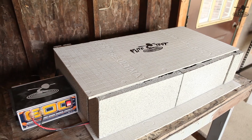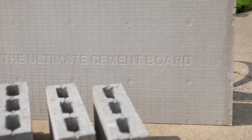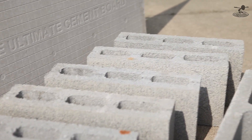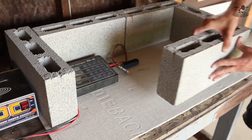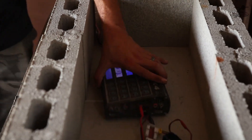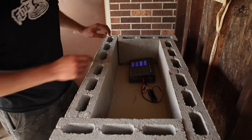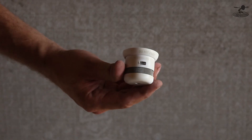So today we've made a new battery bunker. How much did it cost? About 20 bucks. I went to Lowe's and bought one sheet of two-by-four Hardy Backer board — that's cement board, and you can cut it with a utility knife using the score grooves on it. Then I bought six thin-wall cinder blocks. I simply made a perimeter, put the charging station inside, and placed the DC power supply on the outside since it does get hot after a while. Then I made a lid for it so the whole charger fits inside. The nice thing is you can use your balance cables, and if you do have a fire you might sacrifice your charger, but by using balance cables you're far less likely to have a fire in the first place.